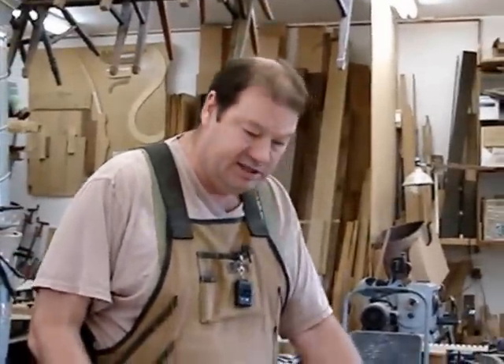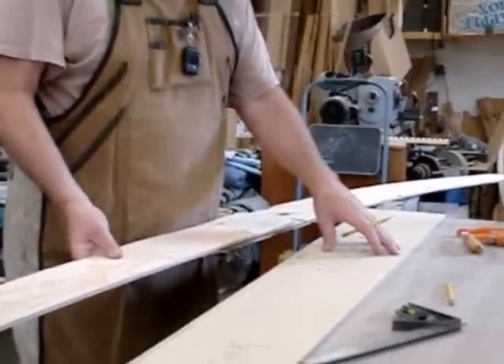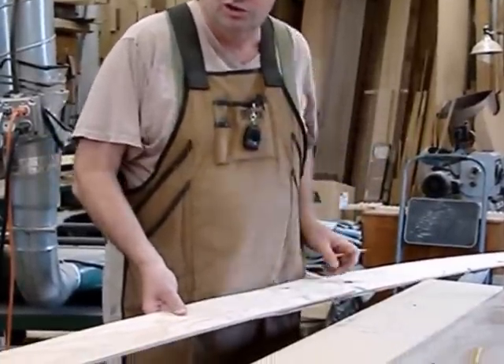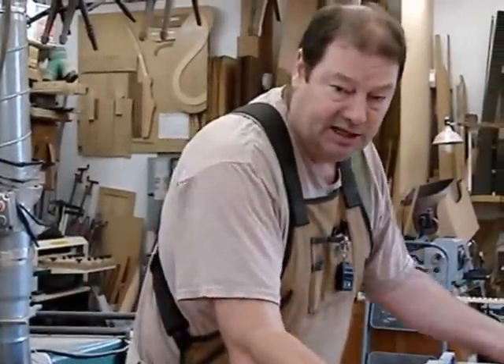So now I'll use this as a template — I'll cut this piece out. This piece of MDF is a template, and then I'll use it to route all four corners of the table. It's also the same radius on the leaves, so we'll also get the two leaves which are right over there. Then the table will have its shape — the subtle curves of the mid-century modern.